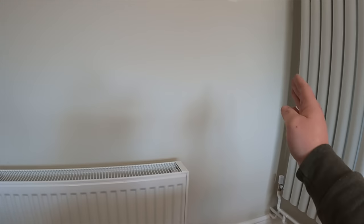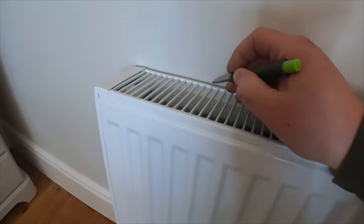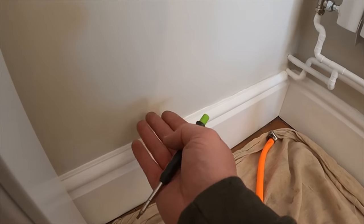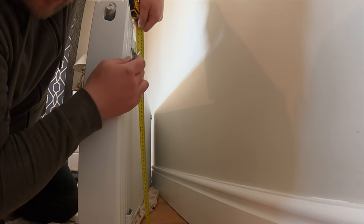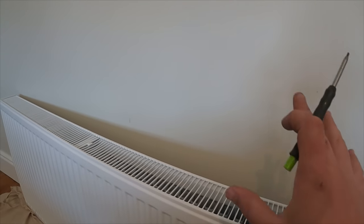The customer wants the rad between this point and the edge of the cupboard. We've worked out the center of the wall and the center of the rad and put a mark on there for the rad bracket. To get the height of the rad bracket I always measure from the floor to the bottom of the bracket - on this one it's 520mm, plus 80mm we're allowing for the pipe, so 600mm to where the top of the bracket goes. We'll level that across, get the brackets on the wall, and get the rad hung.